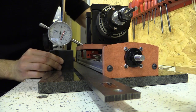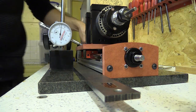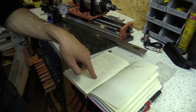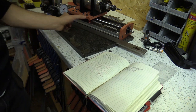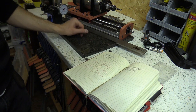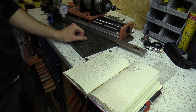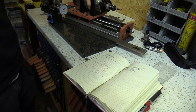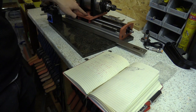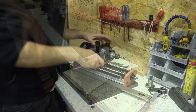It's not consistent — it's less than 0.16mm in the middle, 0.12mm at the bottom, and 0.07mm at the top. That's a slight deviation in the plate, so obviously the rails are not perfectly lined up. I'm going to take the spindle off the spindle plates, loosen everything up, and see if I can reduce that down a little.